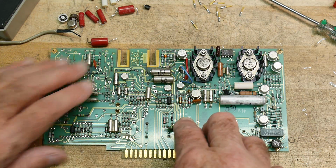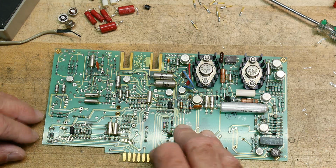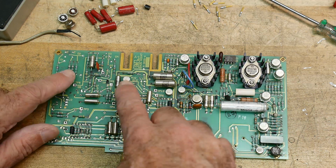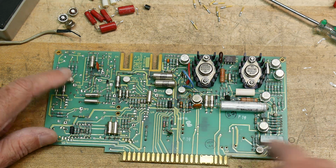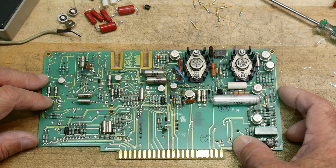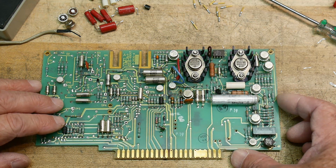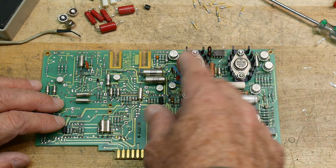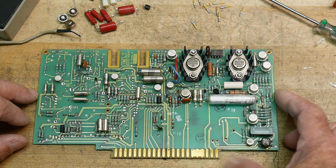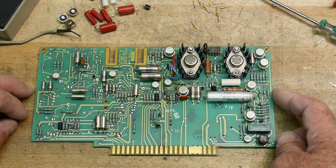This is like the measurement side. And I said, oh, these are nice capacitors. I'll save those, so I took those off. Not going to save the tantalums, although these are really nice ones. Might pull out these resistors later on. I don't know. Anyway, I got rid of most of the current draw, I think. There might be some voltage dividers that are eating up a little bit, but maybe I just go through and cut them all off sometime. Anyway, it should be a whole lot better. In fact, it might work all just by itself, just doing that. But anyway, I'll go ahead and test it. I'll put this back in it, and we'll do a load test and see what kind of current this thing can supply. But this should be a lot better.